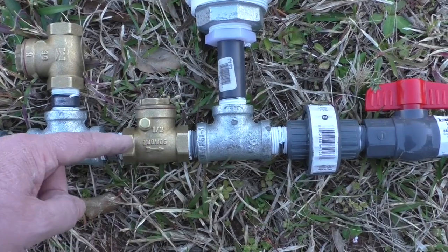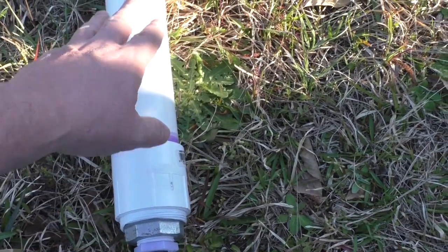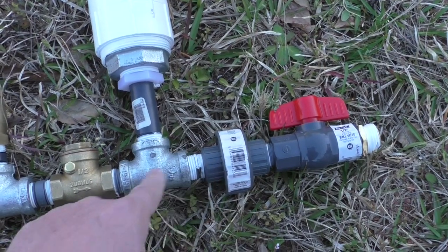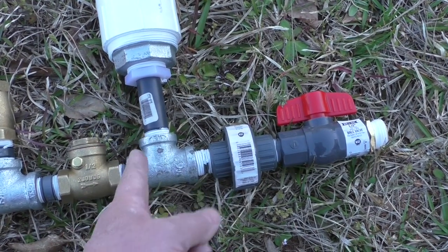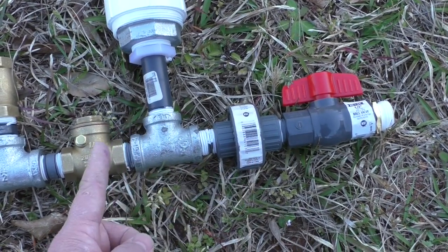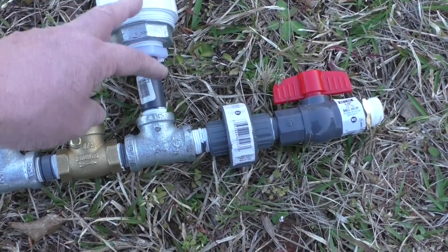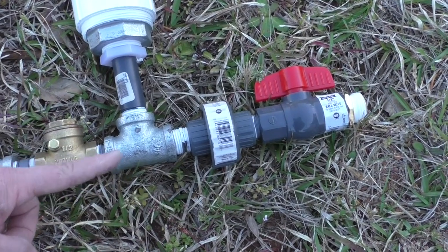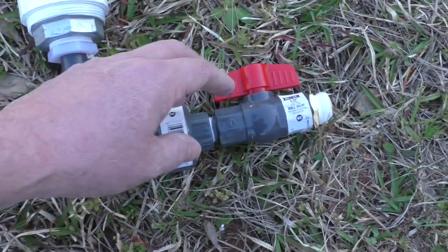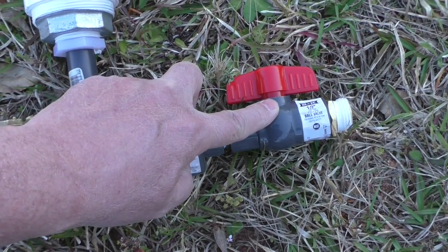Now, on this particular valve, you want it to open up when water pressure comes this direction, and then when the inner tube rebounds and forces the water down here to this T, it's going to go both directions. Well, I want this flapper valve oriented like this, so when the pressure comes back this way, it shuts this valve off. So my orientation on that one is for it to flap in this direction. Once that happens, all this compressed water that's being pushed down can't go this way any longer and is forced out this direction. Once again, we want to build up some pressure when we first start, so we want a cutoff valve on the output side as well.